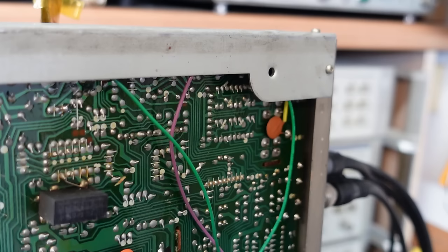I just spent the last hour experimenting with that board, removing resistors, swapping capacitors and taking transistors out. Basically nothing worked. The only thing I can tell you is if I disconnect the input cable, it's nice and quiet, so it might just be an artifact of it being a low pass filter. But I am going to swap the chip with another one on the board, just in case. And this chip on the main board's for the microphone input.